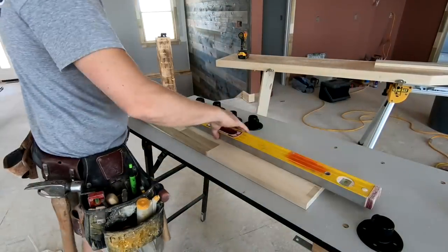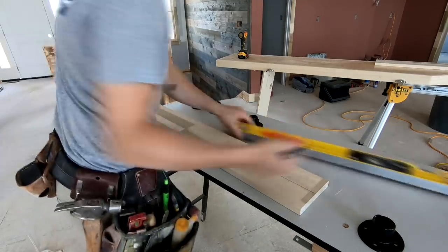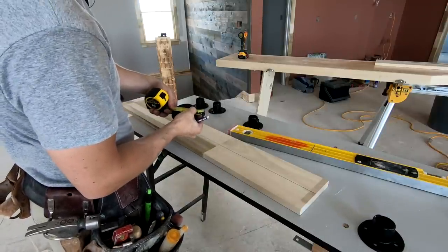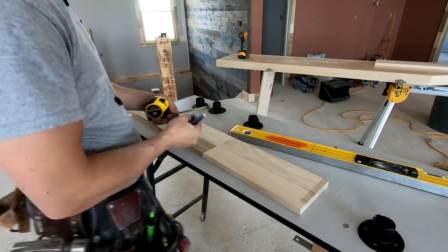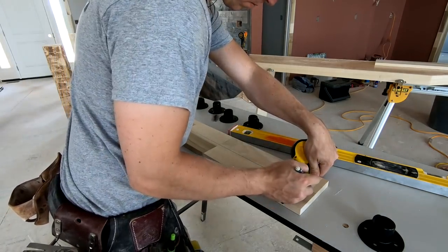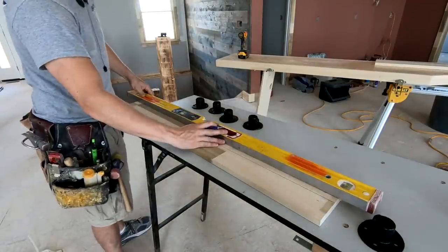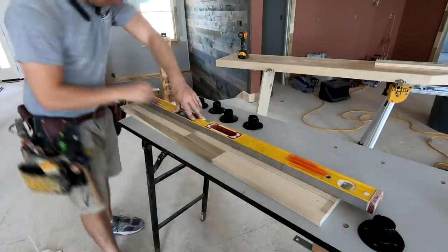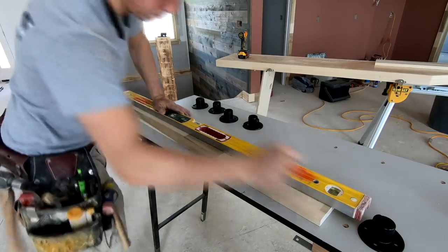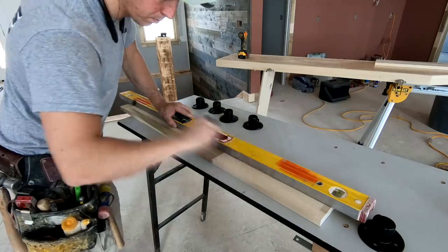What we're going to do here is make a master template that we can drill all five brackets — which would be 20 holes in each of the newel post sides — just in one shot. That way there's no measuring and marking and everything will be perfectly consistent. I'm starting off by marking the center line on this one-by-six, which is the same height as the newel posts. Then I'm going to add two additional lines off the side of my center line, and that's going to be the line that the screws will align with for these brackets.